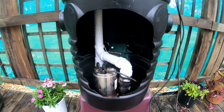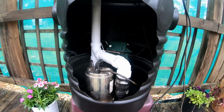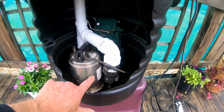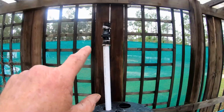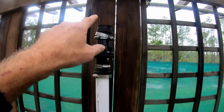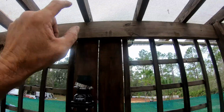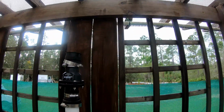So the basement sump basin and pump sets up just a little bit differently. Everything's the same down here. We still have a check valve on this pump, on the battery backup pump, but on the main pump, that check valve is now above the basement floor because this is easier to get to, easier to work on. Remember, this line would come up, keep going up until it comes out above ground in your basement. It can go through the band plate, or it could just go through the block, depending on how you want that, underground or above ground.